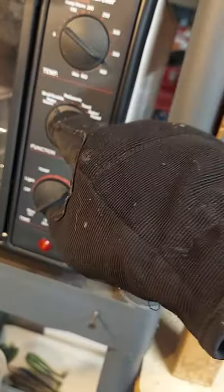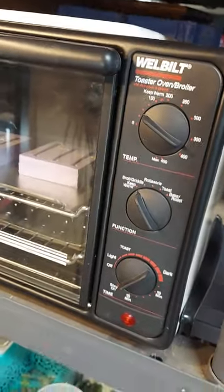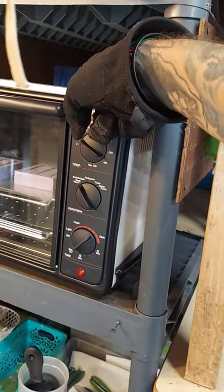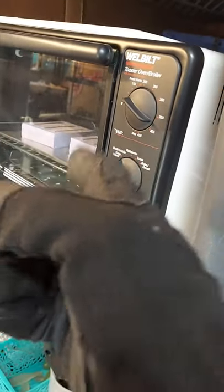This is a pretty cool toaster oven — it's got a stay-on feature to keep warm, so I can set my temperature on keep warm. There's a griddle under here if you want to make pancakes or heat up an aluminum mold, so it's really got a dual purpose. I haven't tried it for heating up an aluminum mold, but the griddle's right there. We use it to avoid cold cracking — for even heating of the mold when I use the heat gun.